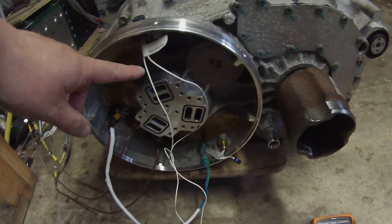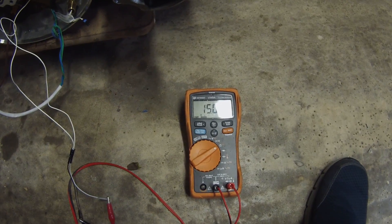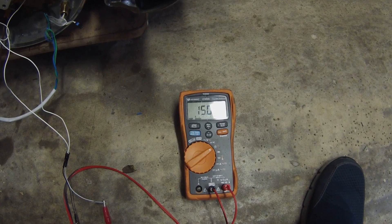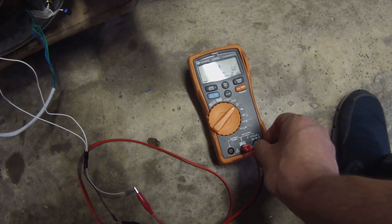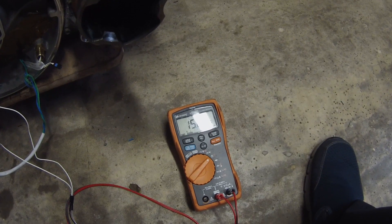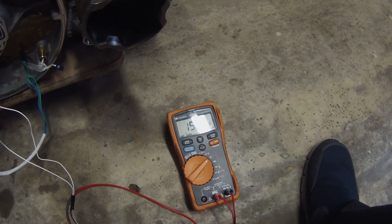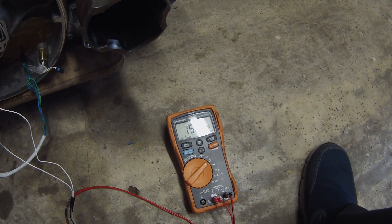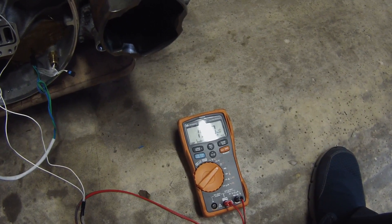Out in the shed now for a quick look at the current sensors. We have four in total — two mounted in the casing. Putting the multimeter on the first one I'm getting pretty much bang on 15k ohms. I swapped the wires over and it didn't change, which tells me this is most likely a resistance device — if it had changed it might have been one of those KTY-type sensors.